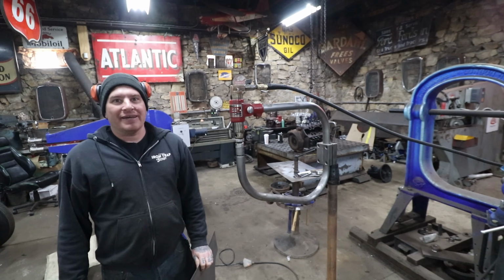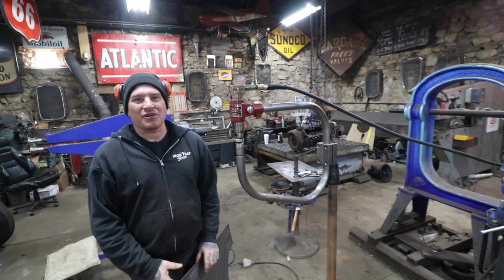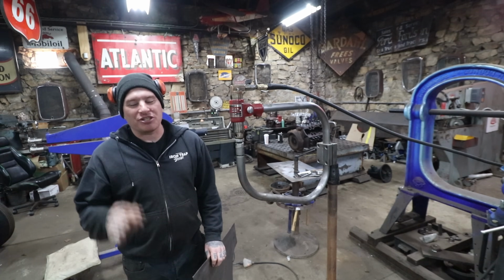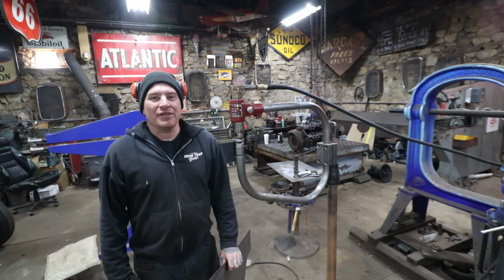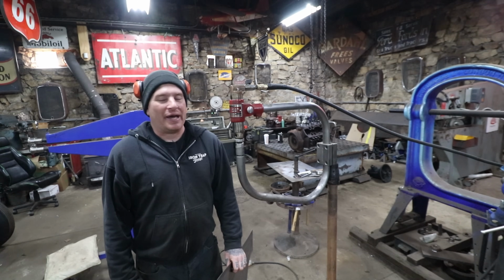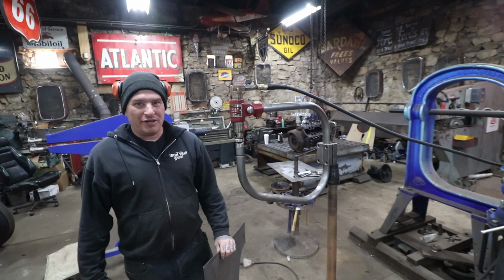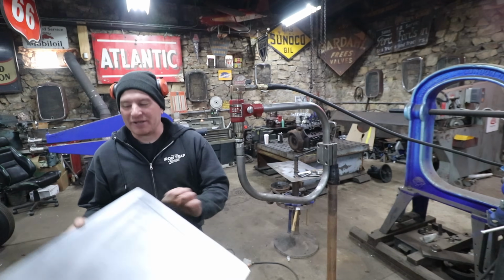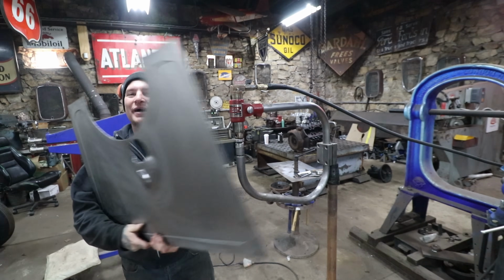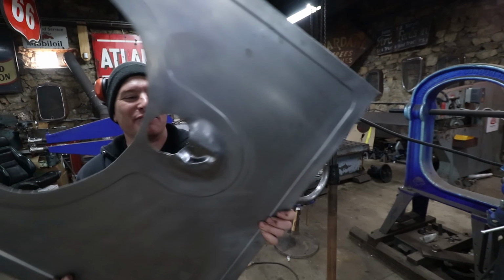But I did a test run of the panel, and I knew it was going to be tight around the blister. Well, I was wrong. It would change just enough when putting the step in the panel that it dug into the panel, caused an issue. I had to just smash it flat. I mean, this is part of just knowing what metal does. We can smash it flat and correct it. So my nice shiny blister I'd put in the panel now is all effed up. So I smashed it flat. It is what it is.